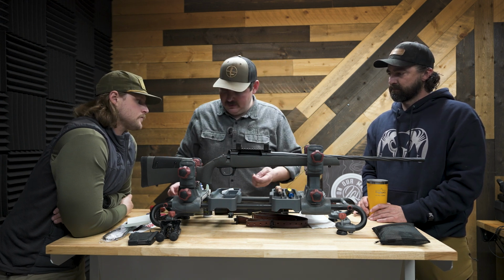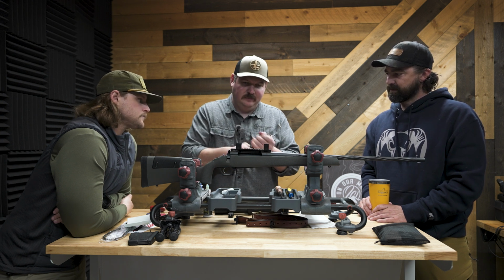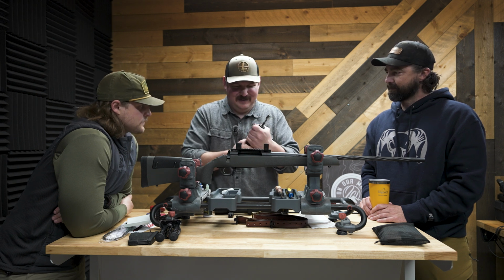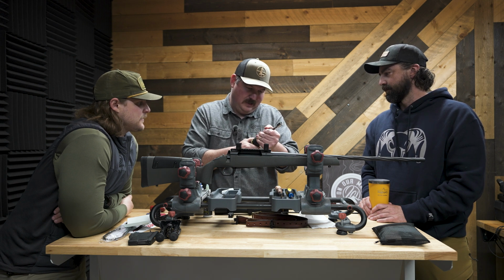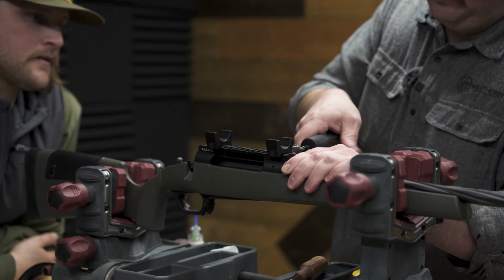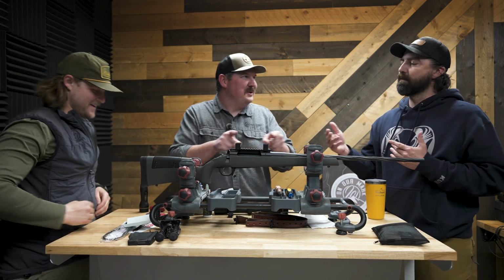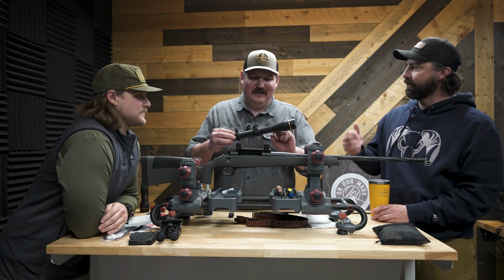And then take our 1/2 inch. Back to the torque wrench. What are you setting it to now? 65 on these guys, 1/2 inch nut. It takes a while to get there. Got to crank her down. Almost there. Too far, backing off a little bit. All right. It's just a habit. I know they're not connected, but you're balancing your torque. If it was a one-piece mount, you would want to do one at a time. I'm used to doing it like the lug nuts on your car. You don't want to do all the torque on one first.